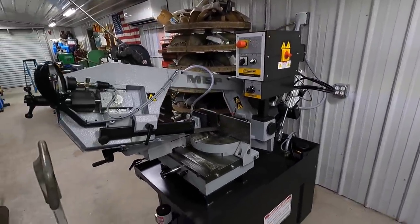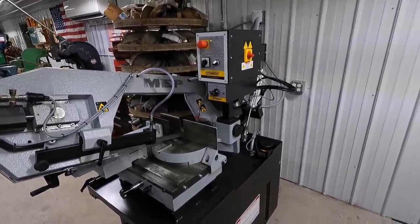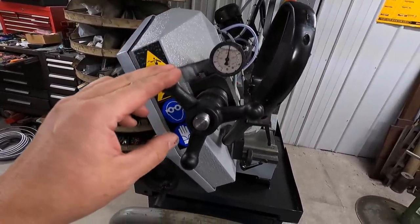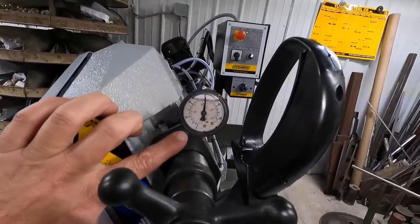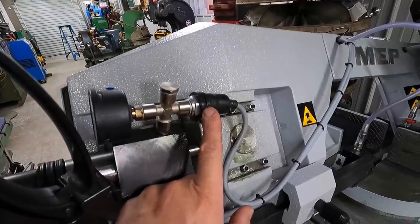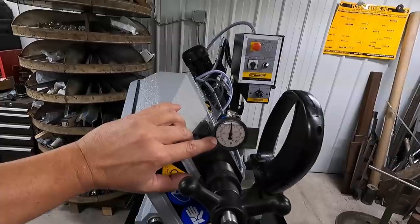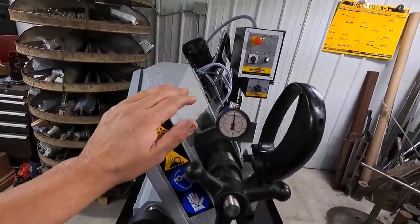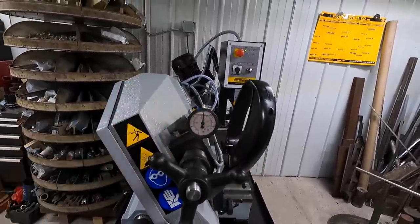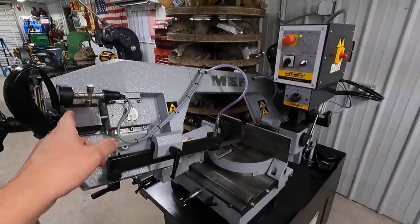It took me a minute to figure out what I was doing wrong. I couldn't get the saw to operate when I first wired it up. Went back to the book, re-read some things, and noticed — this is your blade tensioner right here, what tightens up the bandsaw blade. You have a hydraulic pressure gauge indicating how much pressure you have on that blade, and a switch connected to that gauge. If you don't have enough pressure, it will not allow the motor to turn on. It was at 20 bar when I received the machine. The book says to tighten it to 70 bar, so I adjusted it up to 60, tried it again, and it worked. That's all it was — I didn't have it tight enough.